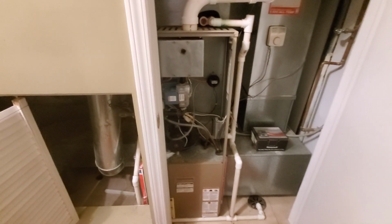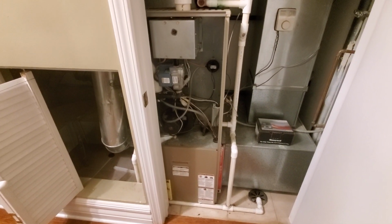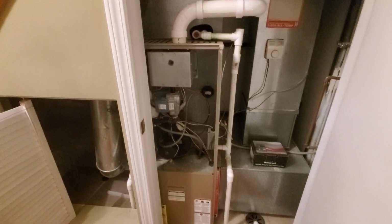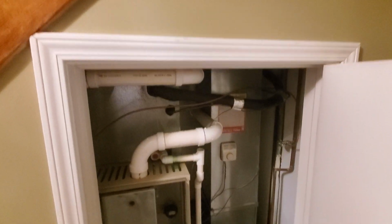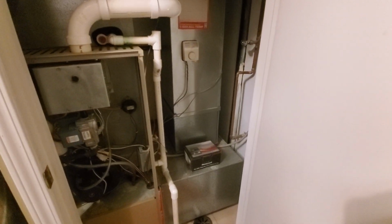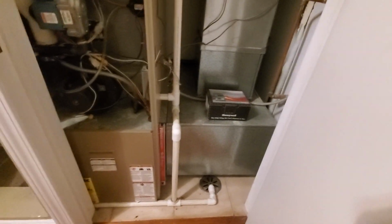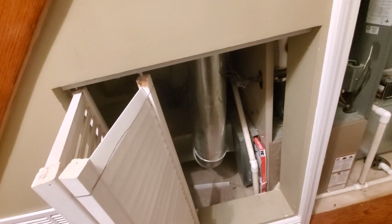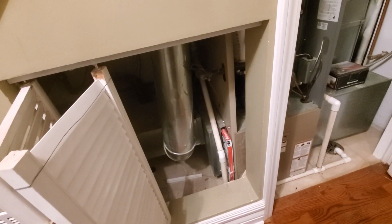Since the new furnace is going to be 33 inches tall, my suggestion is that when the new return drop comes in, it goes into this side, but then return ductwork comes underneath the furnace and connects with this side over here so that we eliminate the second filter.